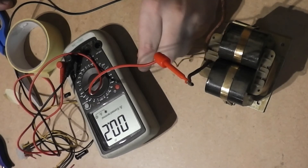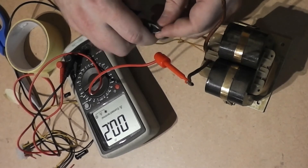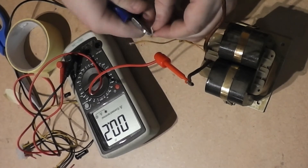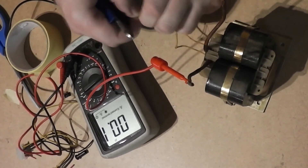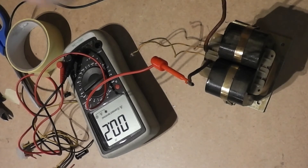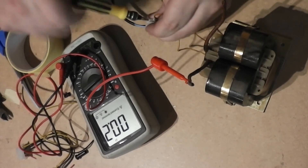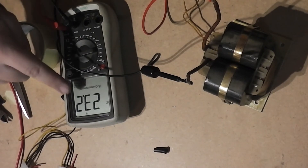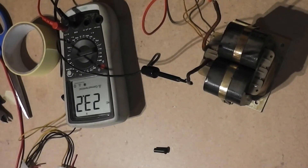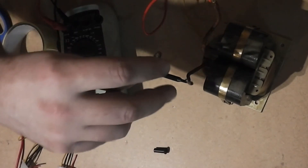You can also see when looking at the wires coming from each coil that the wire diameter is different — the bigger diameter wire will be the secondary coil. Now let's connect it to the main power. The result is 23.2 volts — a very nice transformer. In my opinion, this transformer can deliver up to 250 watts, so it's a very nice power transformer.